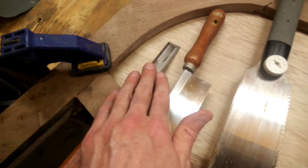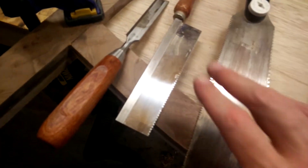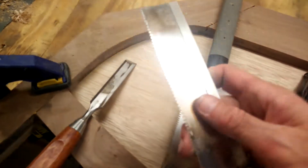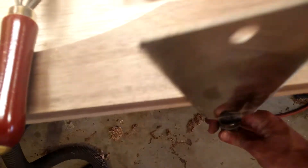These are great — you always want to have a nice sharp chisel set; you can just chip off and chew through little bits of material. Having this tiny little dovetail-type saw is great, though the problem is it has a backing on it so you can't get exactly flush — it angles out a little bit. So I'll use this Japanese pull saw, which you can get flush up on something and trim it off. It's got coarser teeth, so take your pick — you can trim something up nice and tight.